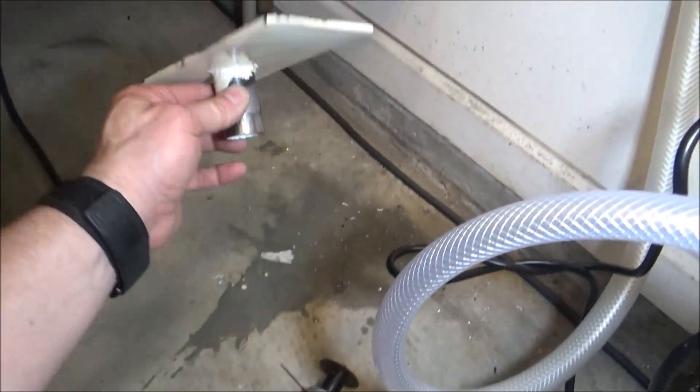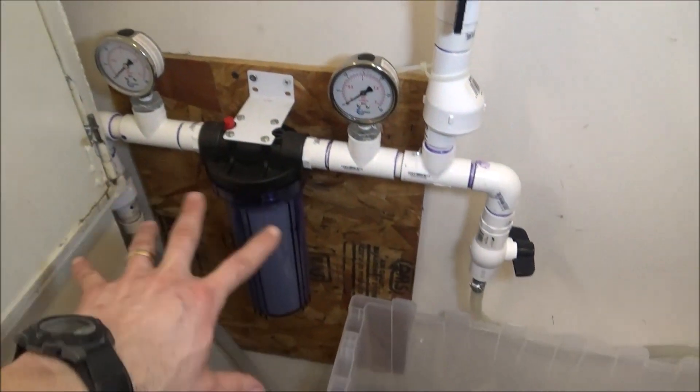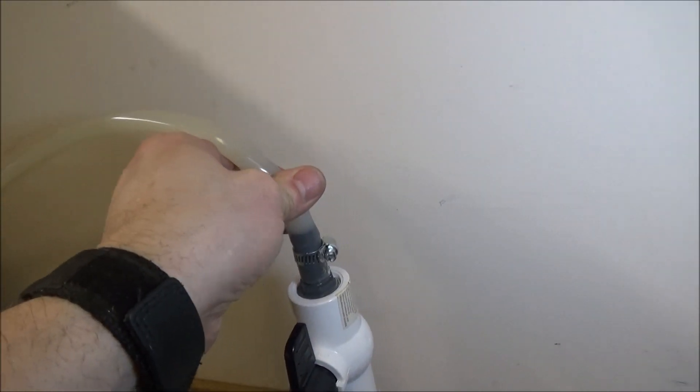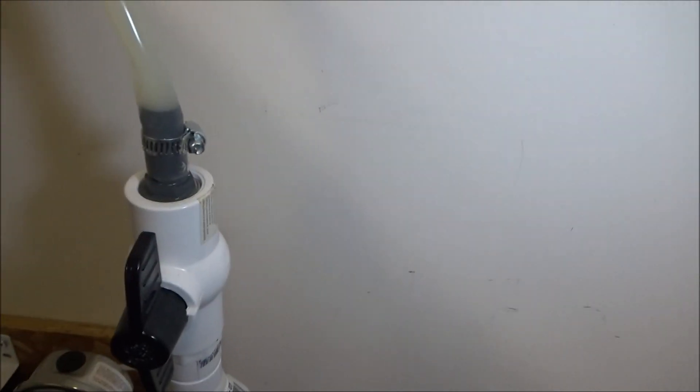Two steps forward, six steps back — that's the way it usually goes. Reluctantly I took my cutoff wheel and cut this off, so now I can slide the tub up under there and everything will drain down into it. I've got that stainless steel screen in there and I'm also adding the number 80 stainless steel mesh to catch all the small fine material and hopefully prevent my filter from getting clogged. I've relocated the filter up here to make it easier to change, and I'm also going to be replacing this hose — you can see it kinks, which probably restricted coolant flow.